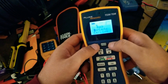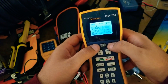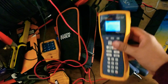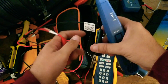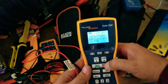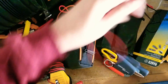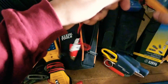There it is — smart tone. I'll enter that in, I'll turn the toner on — same thing. So technically I don't have to carry that other toner, but this is pretty expensive so I try to keep it off to the side. If I'm trying to find DSL lines or other things, this butt set is my go-to. It also tells me the voltage on the line. It's a TDR — time domain reflector — so it'll tell me a distance and locate opens and shorts.